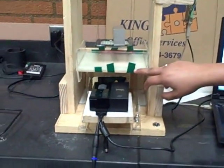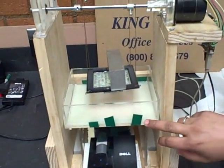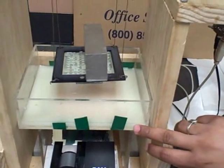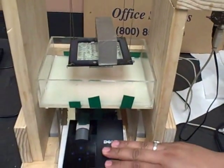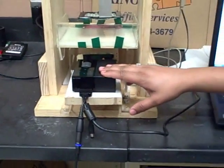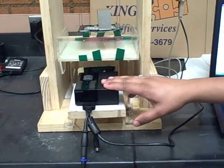This white-colored resin over here is a light-sensitive resin. When it is projected to blue-colored light, it solidifies. With the current light intensity with this projector, we can solidify a 0.016 inch layer in about 4 to 4.5 minutes.